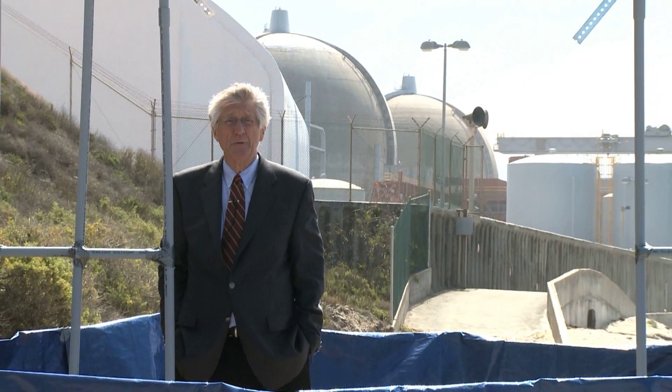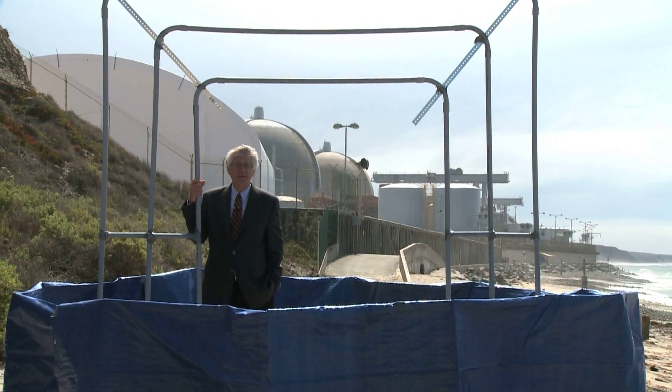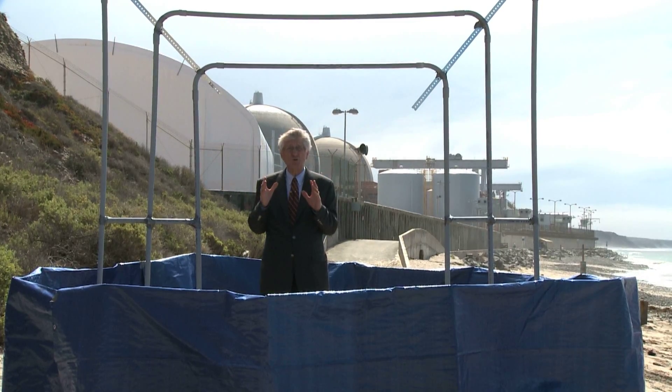That's the most serious accident that could happen in the event of a tube failure at San Onofre, and it would require an evacuation of the people nearby. It would also challenge the emergency core cooling system, because it has to make up for the water that's leaving the nuclear reactor and entering the non-radioactive areas. So the solution at San Onofre is not to plug the tube — plugging stops the leaks but doesn't stop the vibration. The real solution is to go back to the old design.